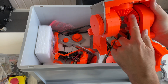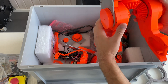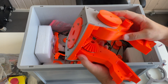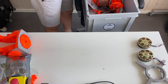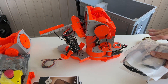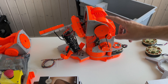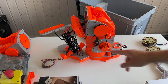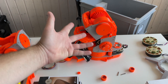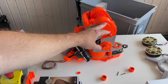You can see there is a differential drive over here, and there is a planetary gearbox inside these pieces. It's a super bulky piece — quite heavy. There are no motors here, just plastic and some bearings, but still it's super heavy. It's actually beautiful. I think I have all the belts I need. From this old robot arm I'm going to keep all non-3D printed parts — especially belts, bearings, and motors. The encoders and drives I don't need. Actually most of the parts in the new design are going to be more or less the same, some exactly the same as on the old design, so I could just use the old parts — but I'm going to reprint them anyway.